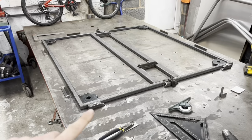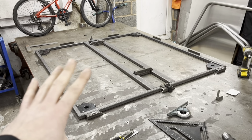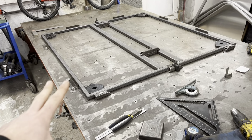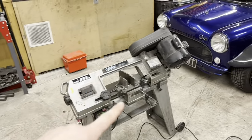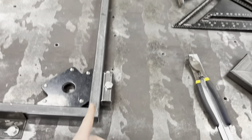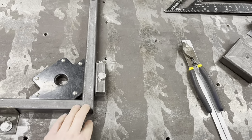Then we have prepped our box section. So it's prepped, it's cleaned. To a majority, all the oils are off it. Then we have measured our box, scribed our box, or whichever way you would want to do it. And we have cut our box to the desired lengths at 45 degrees, unless you're going to go just straight. So you've got the hole on the end, and then all you'll do is cap the hole. You can do it either way.